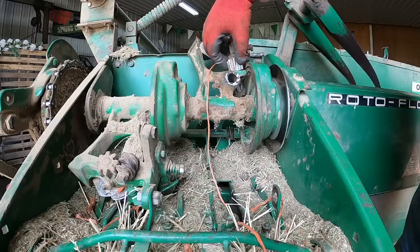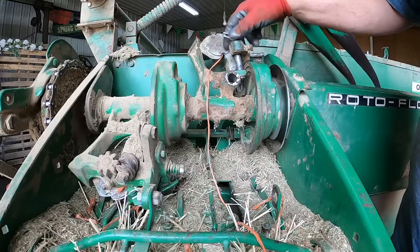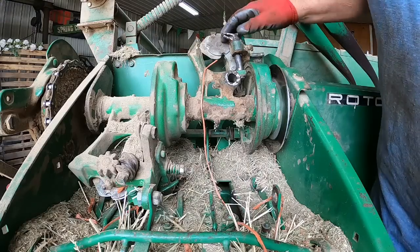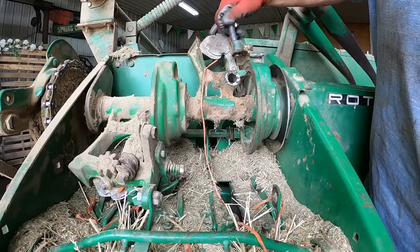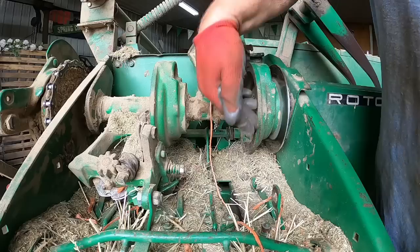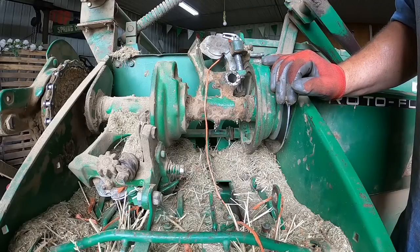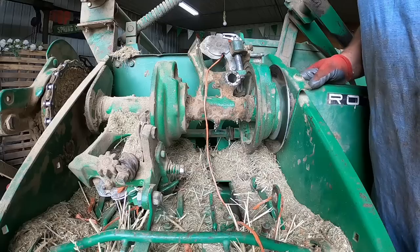This gear should slide out like this. Yes, that fits nicely. Let's just check the old one — definitely some looseness down here. There's no grease on this lower end, so it gets wear. Something to watch out for is there are shims in here that keep the gear spaced right to this main driver gear. And if they get loose — which is what happened to me after years of wear — there got to be too much of a gap there, and a gear skipped over teeth and got stuff out of time. When the needle came up, things weren't in the right place and it busted this casting — cracked it. And then things just wouldn't work right, even after I got it retimed and everything.